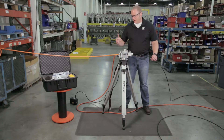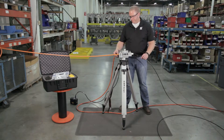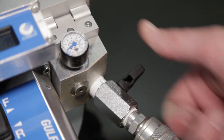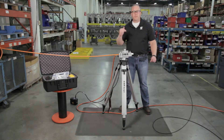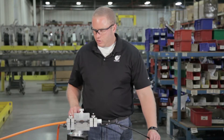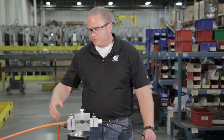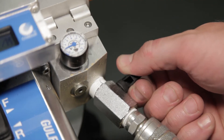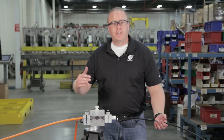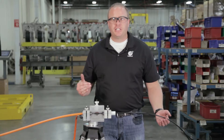Now that we've got some fiber installed, our speed's starting to slow down a little bit, so we're going to introduce some air — just a little bit as needed to pick that speed right back up. When speed drops again, we add another bar or two of pressure and keep doing this to keep the speed going, continually adding air as our speed drops to maintain that installation speed.